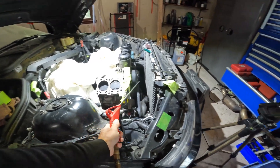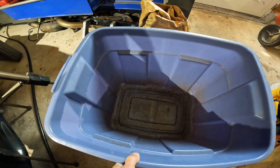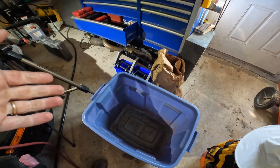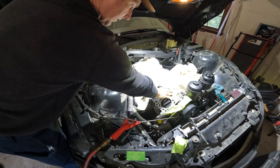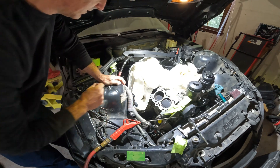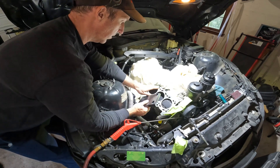There are some tips and tricks I'll share on how to get the job done, because these taps are rather large — if you don't have a really good tap and die set you might have to improvise. You're going to need an air gun and some shop air. I like to have a bucket — you can see I already have some shavings in there. Get some green tape and block off any openings you don't want debris getting into, because you will have metal filings.